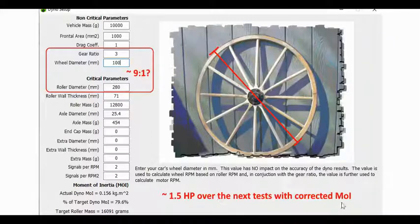At this point I had put the corrected moment of inertia into the system. I made sure that all of the fittings and axle screws and everything were tight, because every dyno run the fittings, motor mounts, and shaft mounts would get loose — the set screws holding the gears would get loose. I tightened everything down. Now I'm getting even higher horsepower output, approximately 1.5 horsepower. Doing multiple tests, it would be anywhere from 1.4 to 1.6 horsepower, which is definitely wrong.